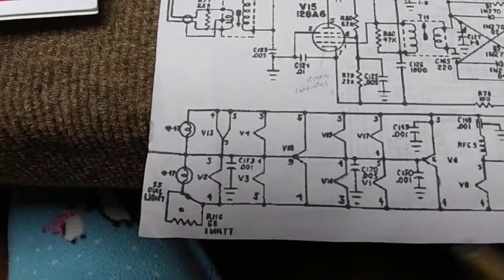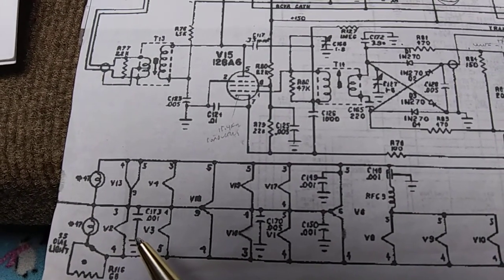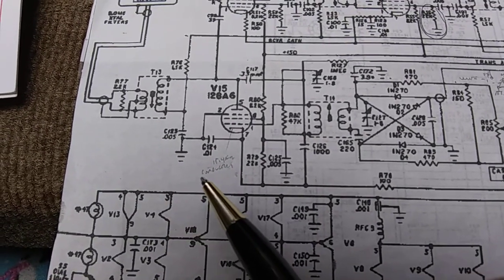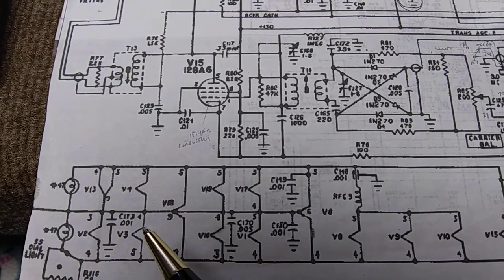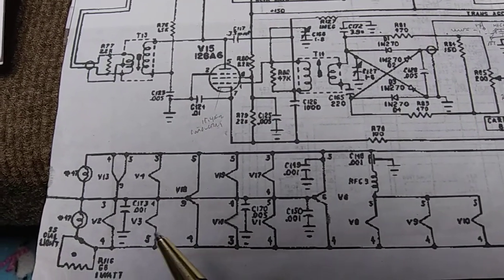Next thing, these front panel lights. Here's the dial light, up here, the sideband lights, these number 47s. If those open up, for example if this one opens up, that will result in way too high voltage on these 6 volt filament tubes. This is a 12 volt overall filament voltage, but it's divided in two through a series filament there and a series filament there with the bulbs in parallel. And if a bulb opens, that will unbalance a string and push the filaments of some of these tubes up to 8 volts, and that will destroy them.